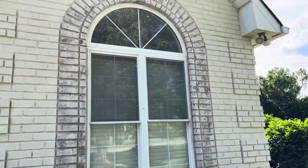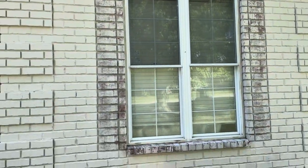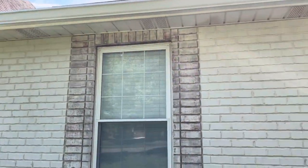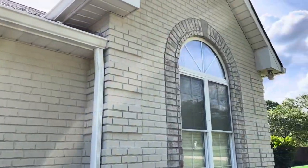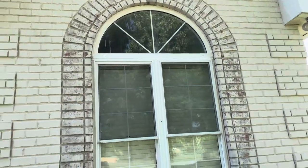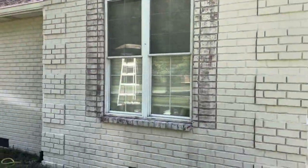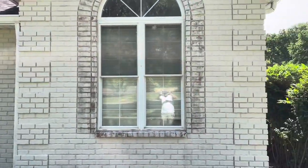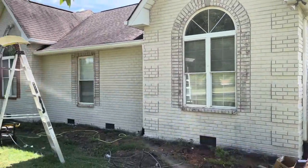So that's how we do it. We took it off the brick to the extent that the customer wanted. You see how both windows are pretty even — they both came out just about the same. We left the same amount of paint on them. What she wanted is kind of a distressed brick look around the windows. And I know there's going to be a wise guy that says, why is he painting on the windows? — those windows are being replaced. So there you have it, folks: whitewash brick accent pieces around the windows. Roma Bio masonry flat mineral-based paint. Gallatin, Tennessee.